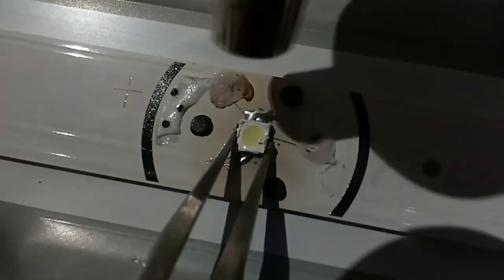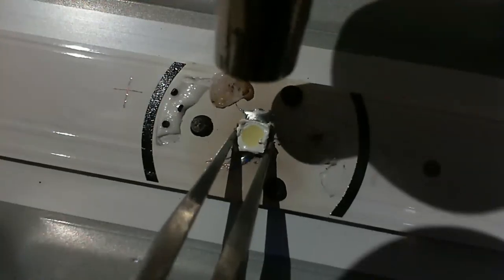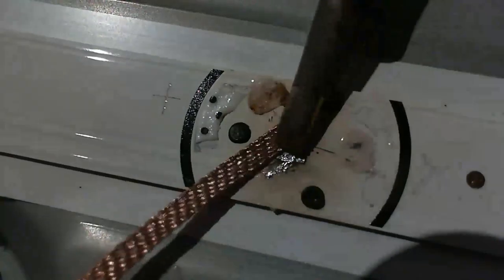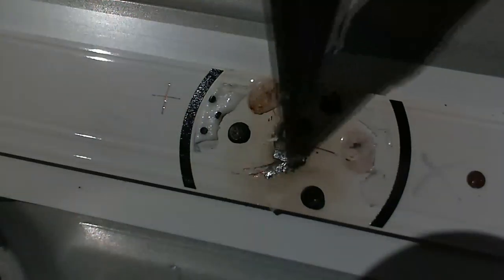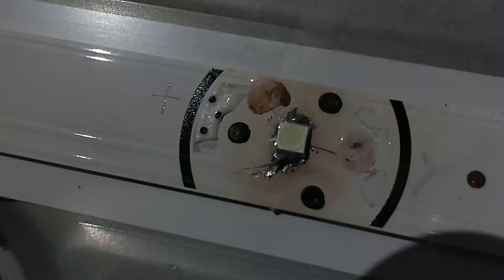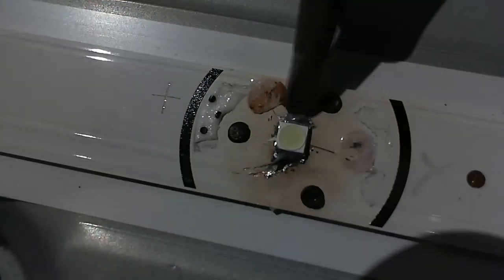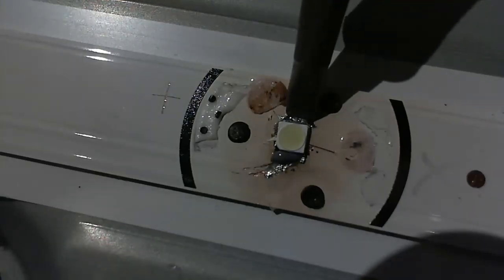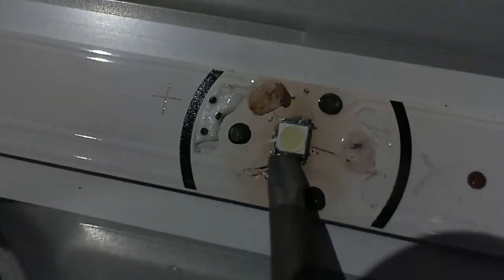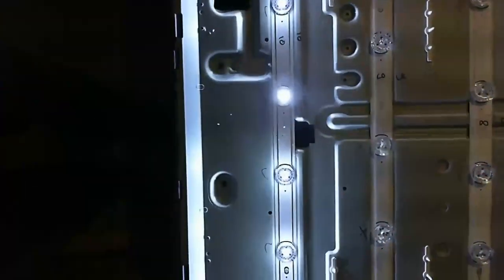So what we are going to do here is remove the LED — that's the one I had bought from Digikey that has the yellow tint. As you can see here I removed part of the copper trace, because this LED had the wrong polarity with the larger pad on the wrong side. I put some solder paste on here to be sure there is some solder underneath the LED. The larger pad is the plus side on this LED — that's the one from eBay. Then just heat it from each side and it's going to lie down flat on the PCB. We can see the color is good.